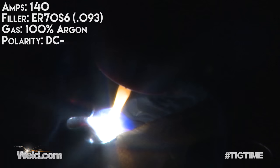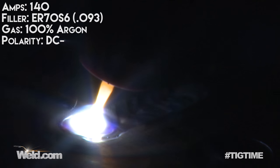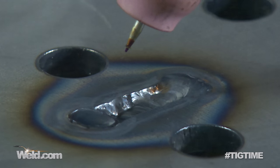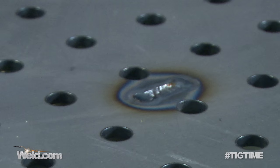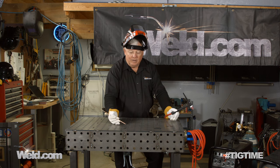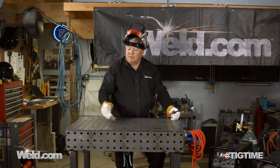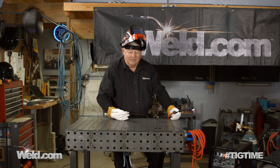I'm getting near the end and I'm trying to keep it just a little bit concave. Later on I'm going to go in and polish it down — it's a tough habit to make a weld concave because you always want to build up a little bit, but in this case you just want it concave. Here's the weld; it probably took me a minute and a half. So I'm going to change over and do MIG welding right beside it. Logically when you look at this, I like TIG — it's easier, it's cleaner — but when you start looking at how many slots there are, MIG welding's the fastest.